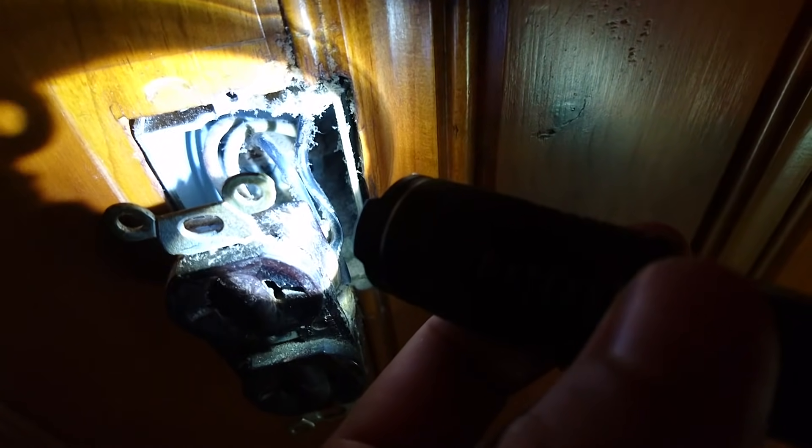You don't want to undersize your outlet relative to your breaker nor relative to your cable gauge. If you notice that your cabling is not sized properly: 12-gauge is for 20 amps, 14-gauge is for 15 amps. If the cabling is 14-gauge while the circuit breaker is 20 amps, replace the circuit breaker and downsize it to a 15-amp breaker.